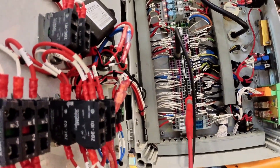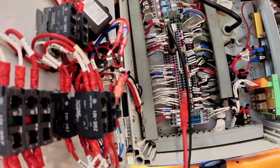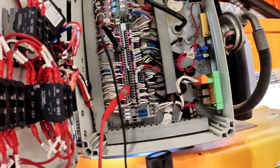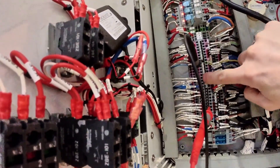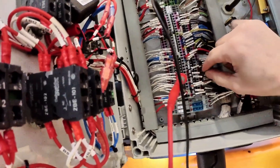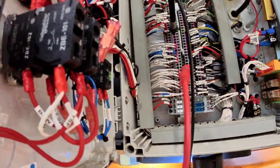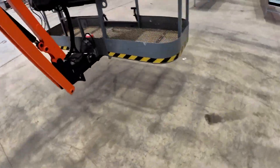Not sure what's going on here. What I will do is measure the voltage on the channel 2 sensor output on the X axis, to see what sort of voltage I'm having — whether it's actually the voltage going high or just the PLC seeing some random readings. I have my negative connected to the ground rail, and the red probe goes into the wire called BAX2. That's reading 2.472 volts with the machine on.